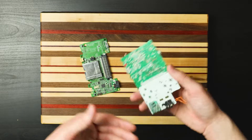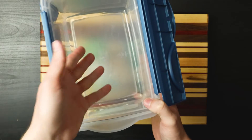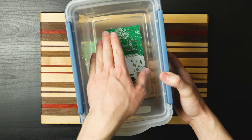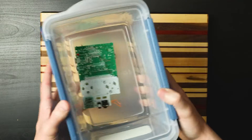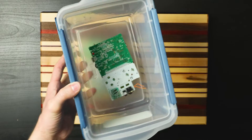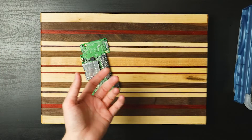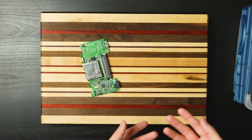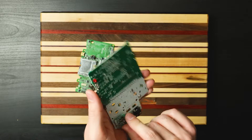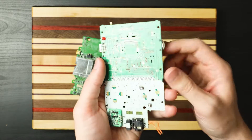Once the cleaning part is done, I rinse off the cleaner with sink water. Then I give it an isopropyl alcohol bath — I literally put 99% isopropyl in there, fill it up so it's above the board, let it soak, shake it around, flip it over, make sure it's getting deep in there. So we can get all that water absorbed into the isopropyl and have it dry as fast as possible. Then I let it sit for 24 hours in an open-air environment on a towel, shaking it out when I'm done. This board has been fully reflowed and fixed — and it is so shiny. I would actually eat off this thing.